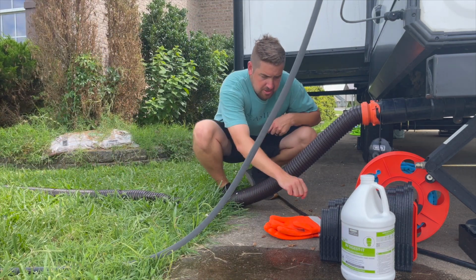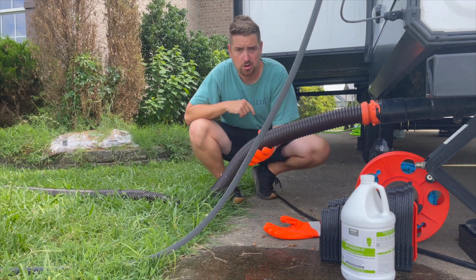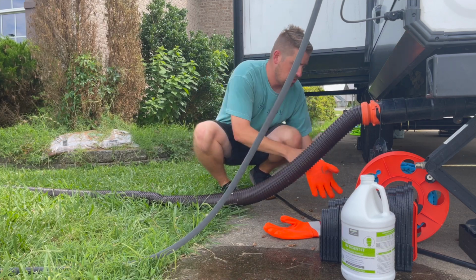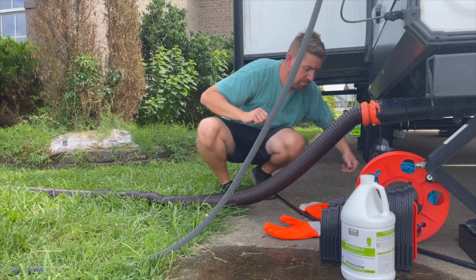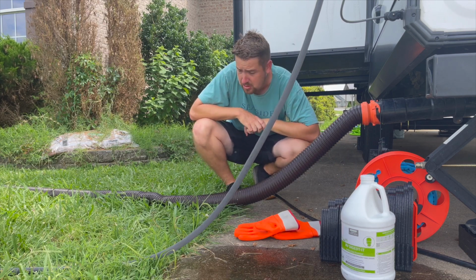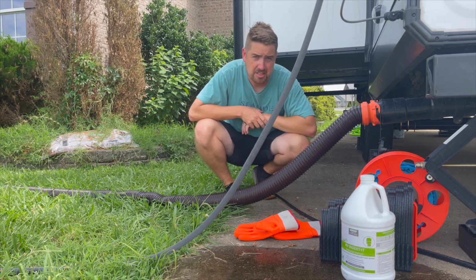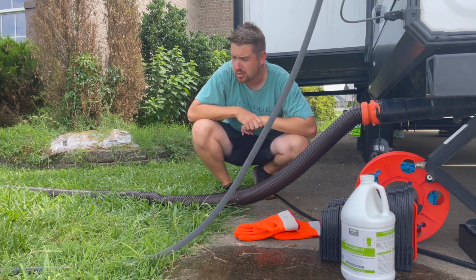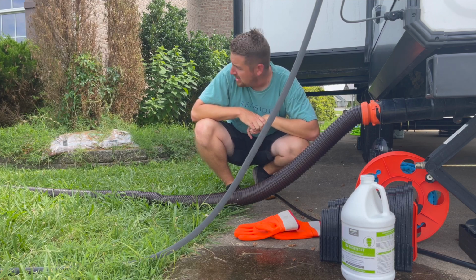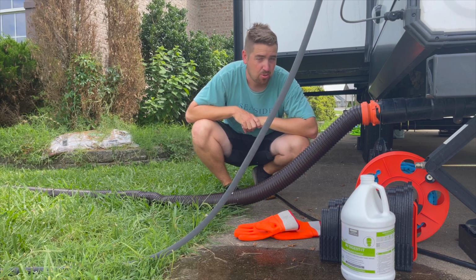So our flow has stopped. Again, we're gonna see how much is in there, touch the hose, always put a glove on. So it seems pretty slow, so we're gonna push the valve back in and wait for the tank to fill up a little bit more, and we'll do it for the 3rd time. Usually about the 3rd time, all the water in the tank's clear, and that's really what you're looking for, to make sure that everything's come out and there's nothing sitting in there just getting old.